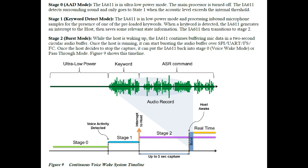What's neat — a cute hack — is that after it wakes up and sends the IRQ to tell the main processor it detected the wake word, it has a circular audio buffer where it stores two to three seconds of audio. This gives the host a few seconds to come out of sleep mode and get memory and processor ready. The host then has three seconds to wake up and read all that stored data from the microphone, which is acting like a little tape recorder.